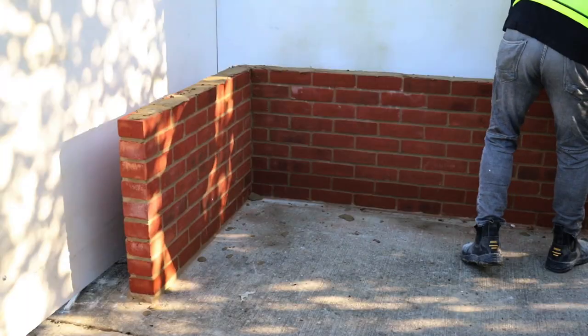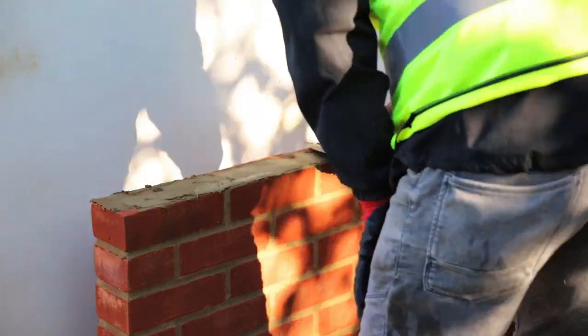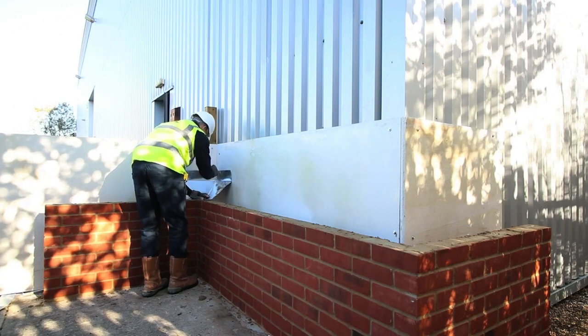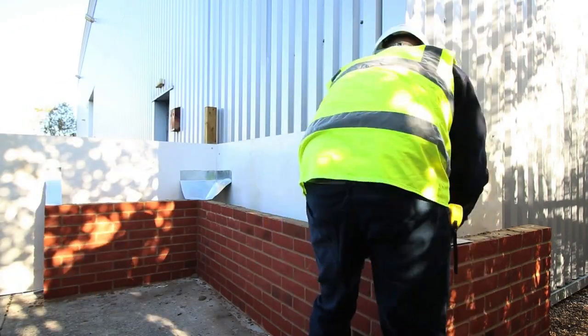It consists of all metal alloy zinc and is a unique new building product and surpasses all other cavity trays currently on the market. The first requirement for fitting the Metz cavity tray is a 5mm mortar bed. The next stage is putting the external and internal corners in position, and making sure it is pressed well back onto the internal board.